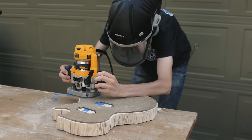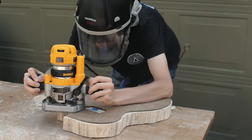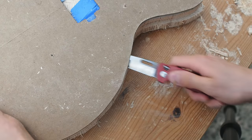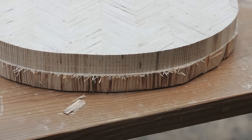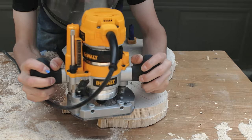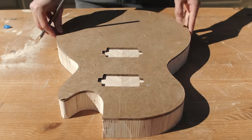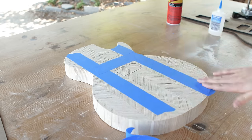It was now time to start routing out the shape of the guitar. For this, I used a small template router bit, which is meant for guitar making. There's a link in the description to the one I used. I then had to switch templates to the one that had the hole for the neck pocket.